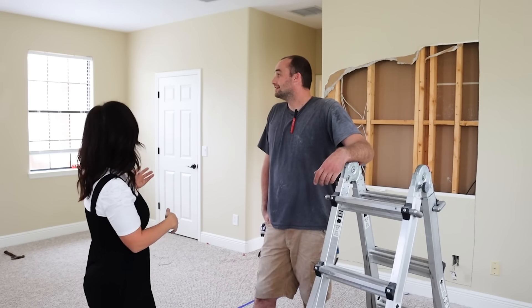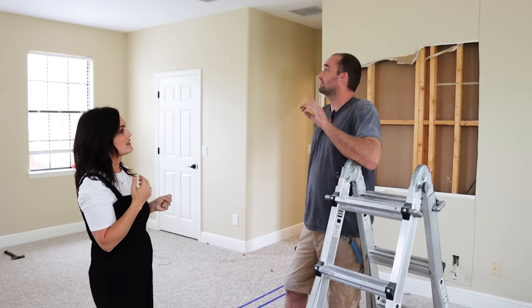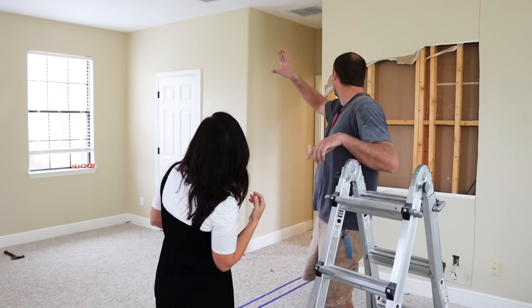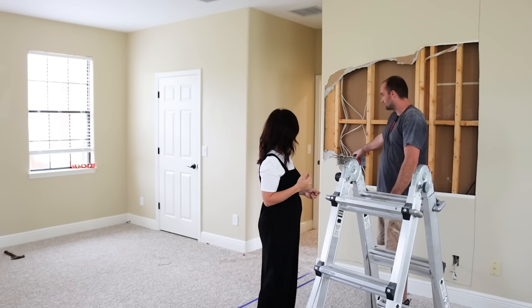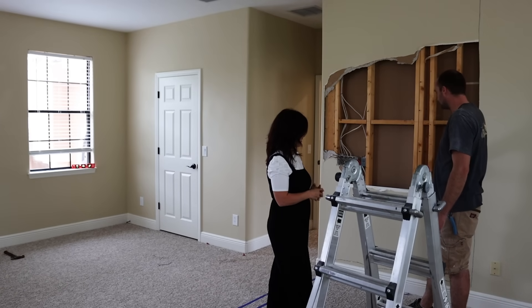So tell me what you're going to do here. I've got a couple of fan boxes marked out that I'll cut into the ceiling, and we'll get rid of this one and move the switches away from the doorway because switches and doorways don't mix. So they'll come over here to make sure that we're out of the way of the doorway.